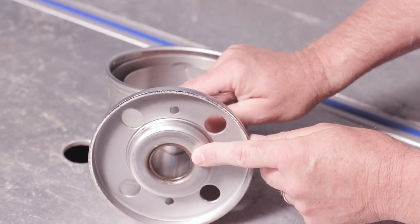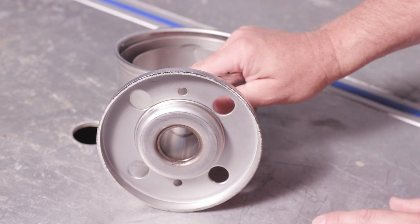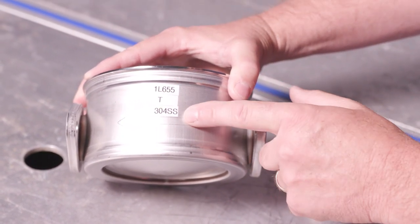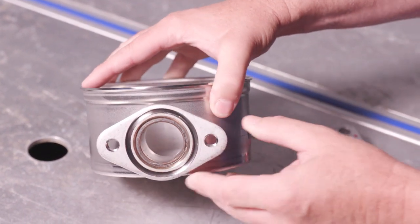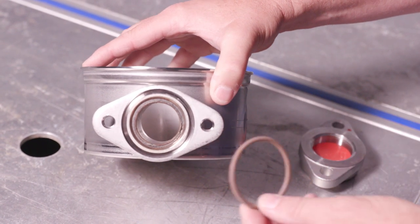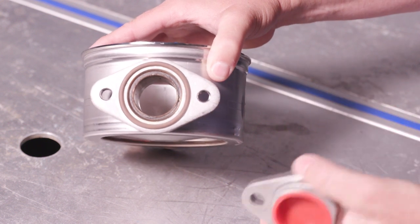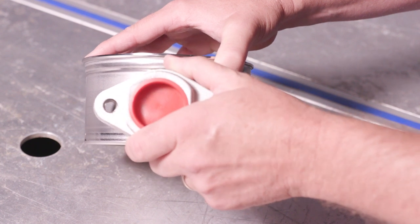That flange does not come with a mating flange — you have to purchase that elsewhere. The next configuration style on the list is the T, which is 304 stainless. We can see that is an oval flange. This one does come with mating flanges, so with a complete pump build you would get the gasket and the mating flange on both sides. That's your oval flange.